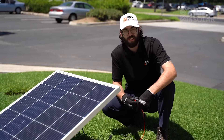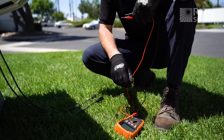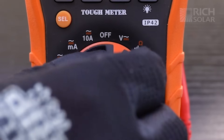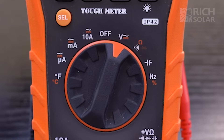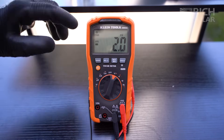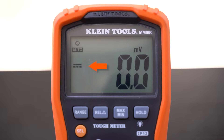Keep in mind that the values you see might not necessarily be what you get when you test, as these values are only achieved in a controlled environment used for testing. First, let's test the voltage. You're going to want to set your meter to voltage — switch it to the V with the squiggle lines, and make sure that you switch it from AC to DC, as indicated by a solid line with three dashes underneath.